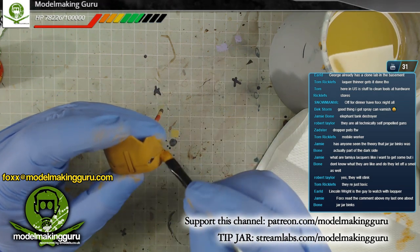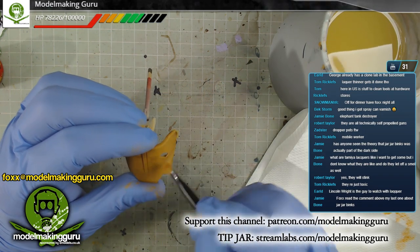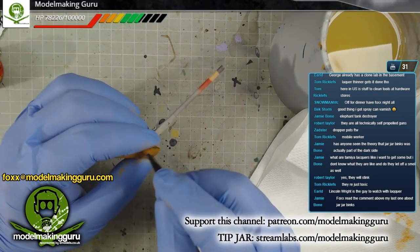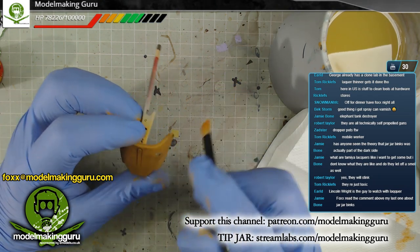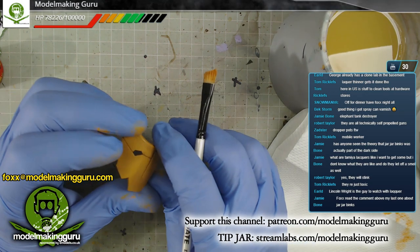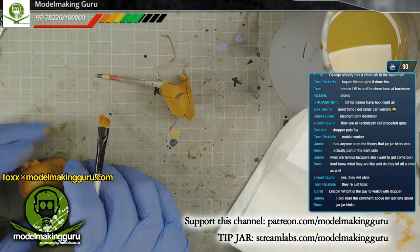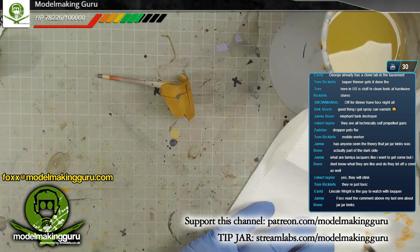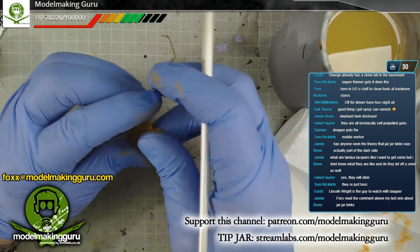The other thing is, if you're working in a room where you also sleep, you sit there and wear a respirator while you're spraying, good lad or good girl, you're keeping your lungs clean. But then a few hours later you go to bed, and all the vapours from the lacquers have risen because of convection. They're all in the air, and you're going to bed inhaling all those vapours that are still there, because you can't really smell them, as you've got used to the smell by this point. So, yeah, lacquers are brilliant, but you do need to be aware and conscious of the downsides.